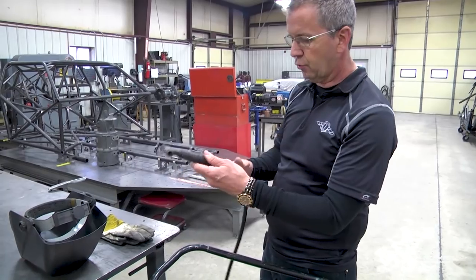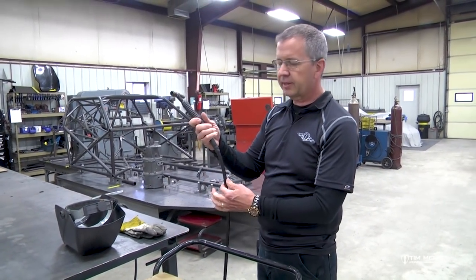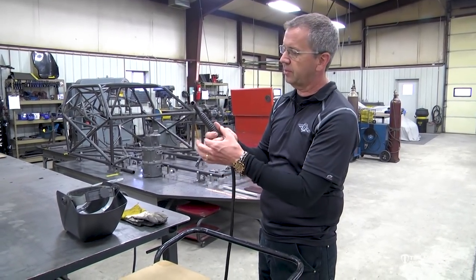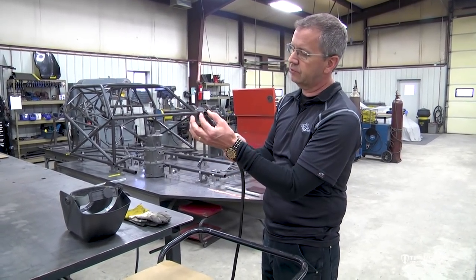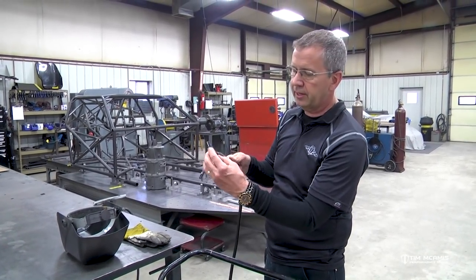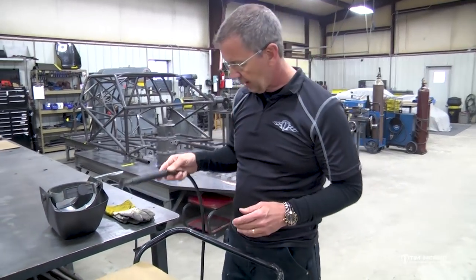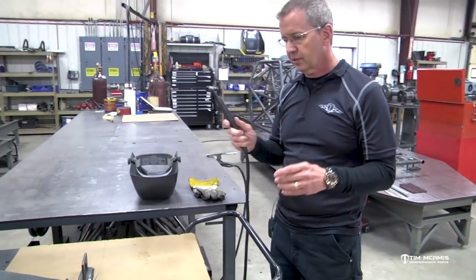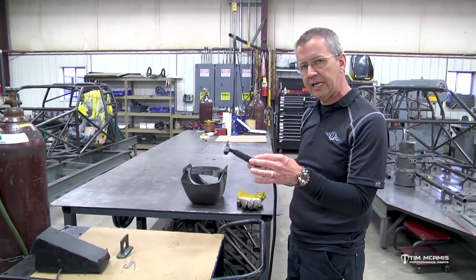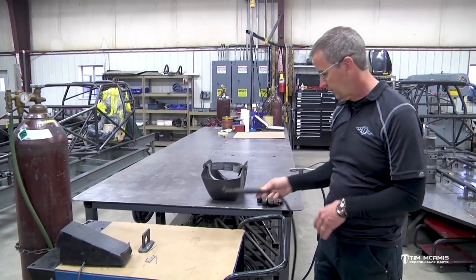So we've got our torch body, and this has got a power cable in it, and it's also got a hose that the gas comes through. The gas is coming down through here, coming out this cup, and it's gonna make that little cloud over the weld as you're moving along. And that's the argon that's coming out of that bottle. So we've got all these items here that we need. This plus the welding rod, plus the foot pedal and a ground is what you're gonna need to make that weld, okay? So we're not gonna do any welding tonight. We're just going over some basic stuff.